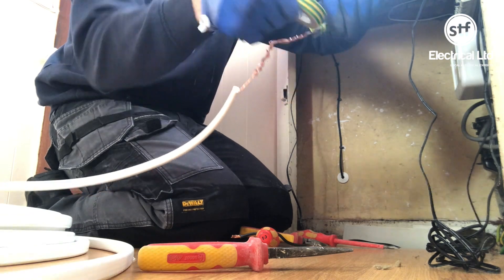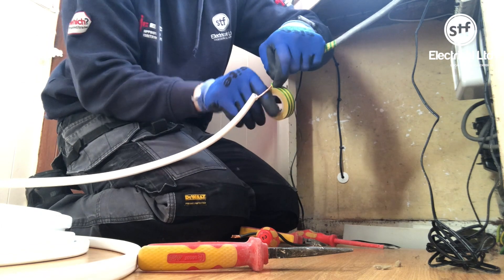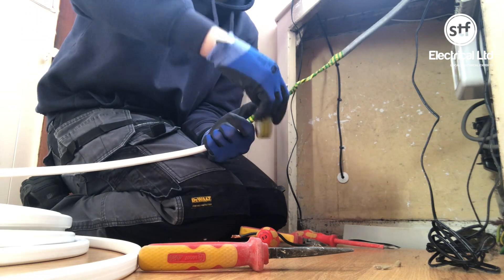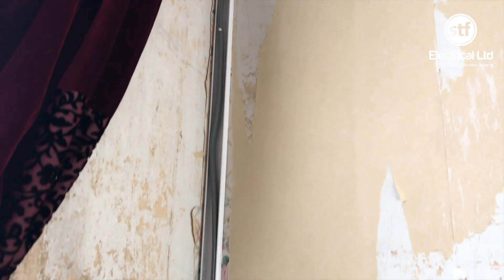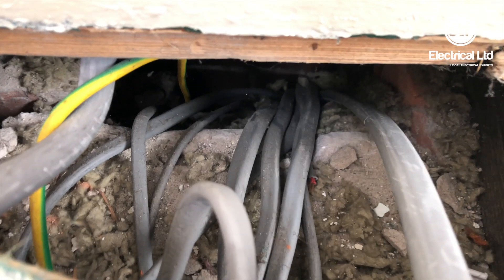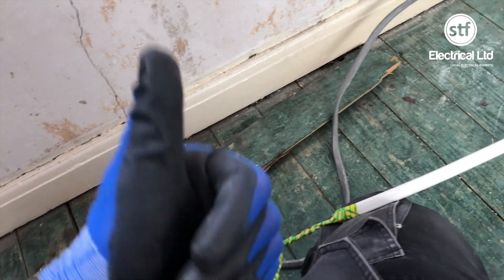I don't normally work like a man on crack — I've just sped up this part of the video. Taking you upstairs now, you'll see the existing trunking that's been going up the wall with the 6mm twin and earth in it. We're just going to take that off and put a new piece on, so everything you can see will be renewed with the new cable going up it. There it is — that's the piece getting renewed into the loft, and you can see the cavity down through the floorboards. Giving the 6mm a tug away, there's our new cable coming up — it'll tuck in behind the skirting board and up the new piece of trunking and into the loft.